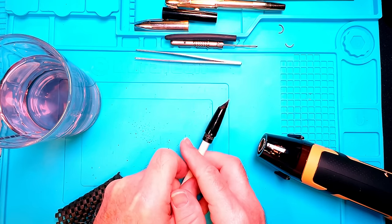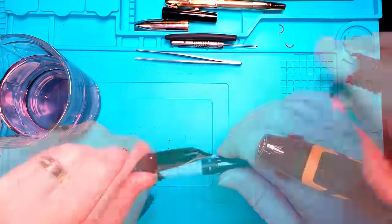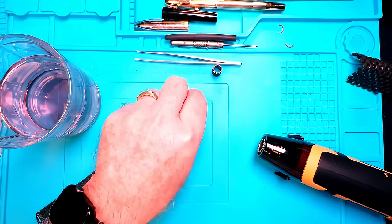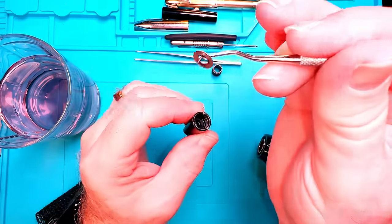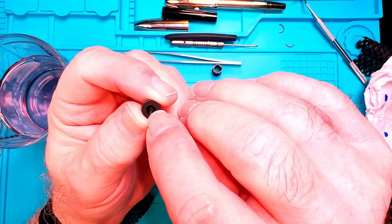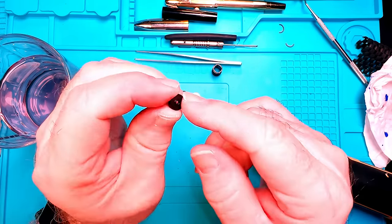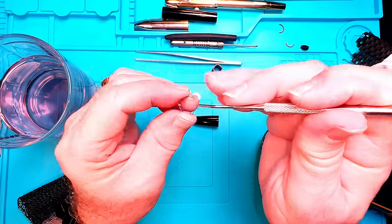Keep checking it to make sure it doesn't get too hot. Apply some grip to both and turn — there. So there's the threaded section from the section, and we'll get out the dental tool to tease that washer out of there. There's the washer — you don't want to lose that, I don't think there are replacements. And there's the point gasket. Actually doesn't look in bad shape, but looks are deceiving — that hole has been going in and out over 60 years and gets loose. We find the new one and put it in there.